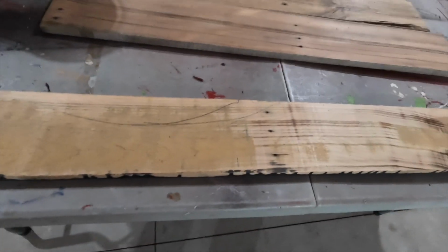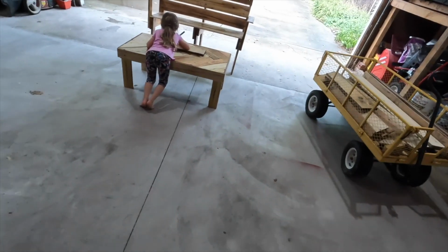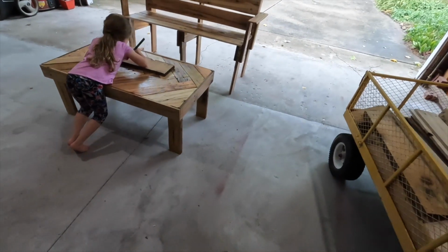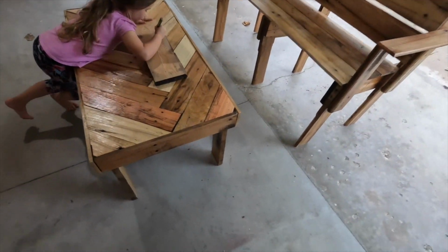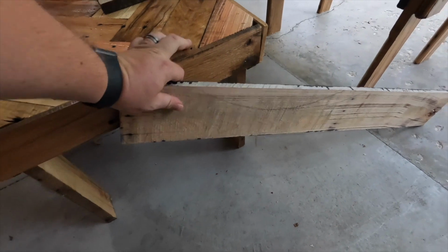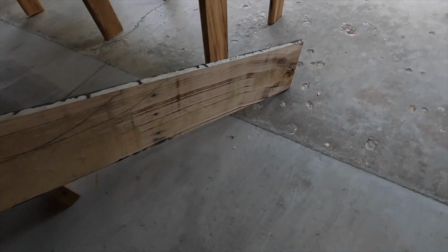Obviously I'm making the cut myself, and once I get one cut, it's a template, and then the others will just go off of it. The last piece, so I thought I had an extreme angle going when I was doing 13.5. I actually decided, for knee height, this coffee table I previously made that I have a video on, I hope you watched that video. I like the height of that. So I put this here, went there and mimicked the angle to cut it down. So I have my template ready to make my cuts on this and go from there.